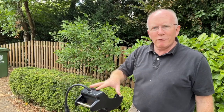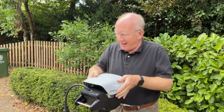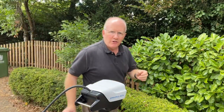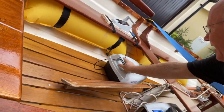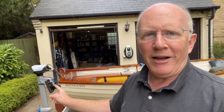To make life easier, I don't want to mount the battery on the motor. Instead, I have this little cowling which goes on here — it's purely decorative — and I have a battery on an extension cable which fits there. That cable is actually going to a battery stored under the thwart here, and I can put the other one under the thwart on the other side. If I run low on power on one battery, I can switch simply by switching the cable over. So now we have minimal engine at the back, batteries with weight more balanced in the centre of the boat, and no tiller — we steer using the regular tiller instead.